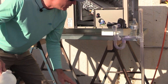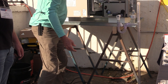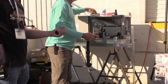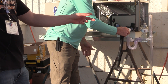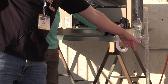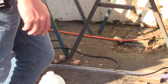Another added benefit: if you're in the attic and your drain pan's full of water, you can take a small vacuum hose — this one that comes with the Stinger will work, but this is nice and convenient and short. Pay attention to this. When you're cleaning out the secondary drain, look at this fitting. The fitting right here is sealed back to the air handler, so all of your suction is coming from your vacuum that's hooked up outside, and you're just cleaning out the drain pan. You don't have to come and go. You don't have to carry anything from inside to outside. Simple as that.